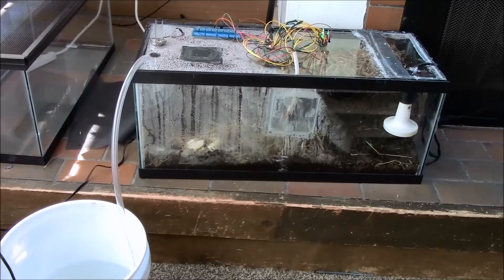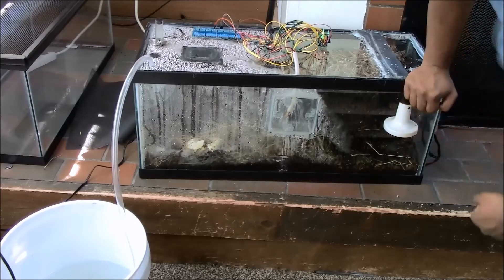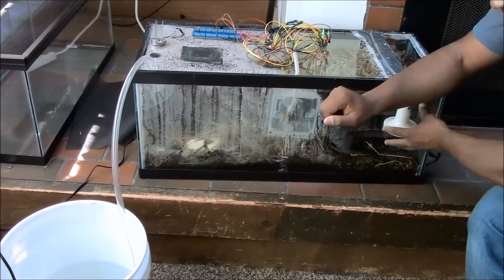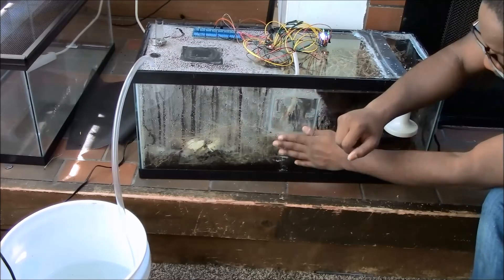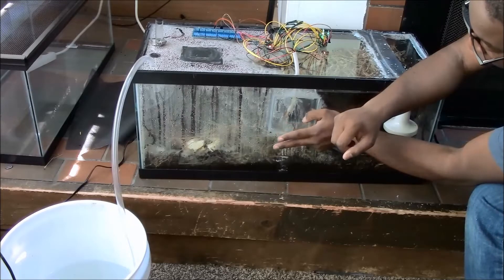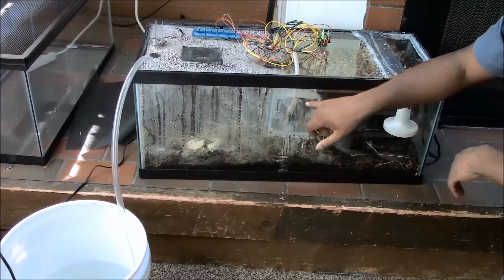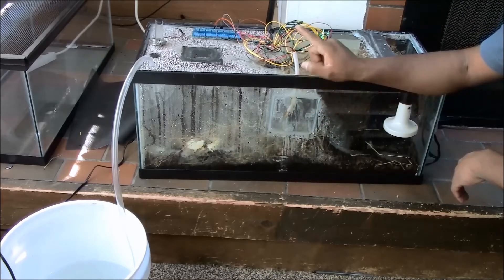If you look inside here you can actually see the heat lamp. This is a low-output heat lamp with a max temperature of 110 degrees, so it can get pretty hot in here. Inside — it's hard to see with all the condensation — there's actually a DHT22 temperature module, which can measure temperature, heat index, humidity, in both Fahrenheit and Celsius. It goes out through a tube that is covered in silicone and connects to the external sensor module.